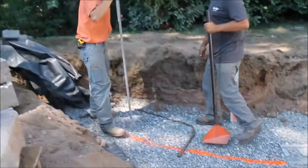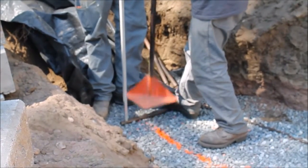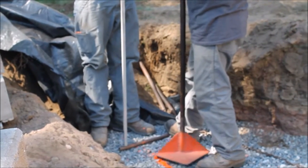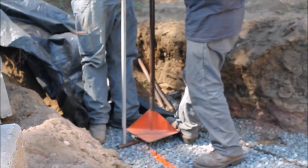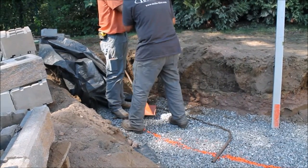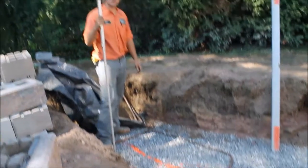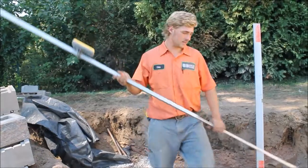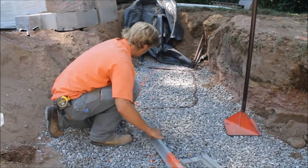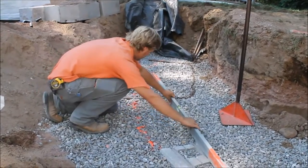Perfect — we got the front and back perfect, now we'll move on to the next point. With our pipes reading level front to back, we've got a perfectly level setting bed. We're going to screed the stone off — first we'll screed the larger 3/4 inch wash stone, going off an existing block because they're stepping up in our base, making sure it's level.